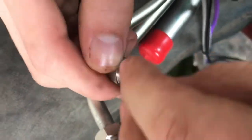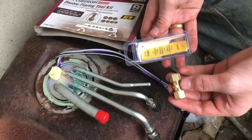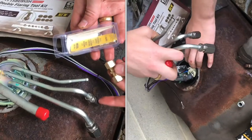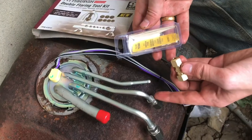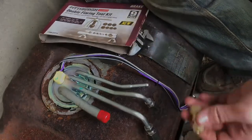Here's the union — just make sure everything still fits together. Beautiful. Although I could have used a compression fitting which is rated high enough for the pressures here, I think it's a bit more comforting to use a flare like the one I have here. I think it's a bit more permanent and it won't back off — I just trust it more.